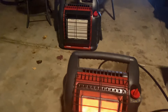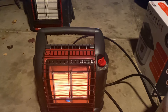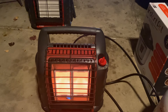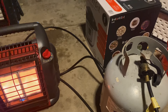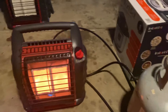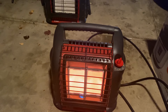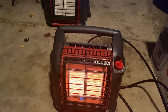Until I watched a video where they explained that this happens with gas grills as well as Buddy heaters — and it was an aha moment. How could I not think of the regulator? So basically, turn this thing on very slowly so you don't startle the regulator. Hopefully this works for you.